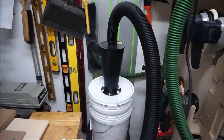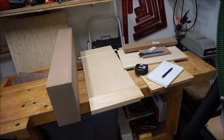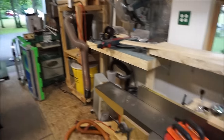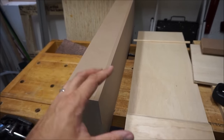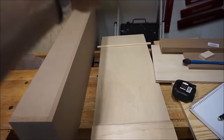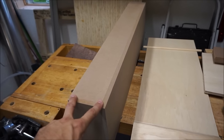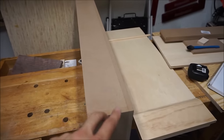There's my static discharging dust deputy. Here on the bench, two projects. This box right here is going to house that vanity light you see in the box way back there — it's going to my bathroom. I needed a box to bump it off the wall because I have a surface mounted medicine cabinet, not an inset one, so the light needs to be bumped out the thickness of the medicine cabinet so that it shines light down and not just onto the top of the cabinet. So that's what this is — a simple box of MDF, biscuited together. I've sanded the whole thing and now it's ready to be sealed. I think I'm going to seal it with a couple coats of shellac and then some paint.